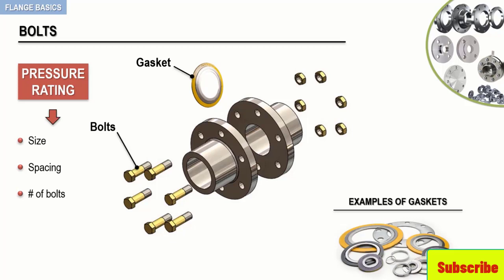Now, bolt hole arrangements, as highlighted in this example, may seem inconsequential. But when you consider the fact that components of a piping system may be fabricated in one country, then shipped to another country for assembly, then bolt alignments become increasingly important. So it is critical that drawings convey the exact orientation of flanges to the fabricator. Otherwise, bolt holes may not align properly.